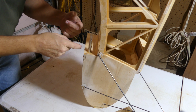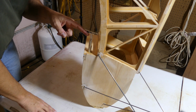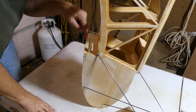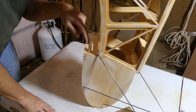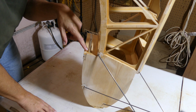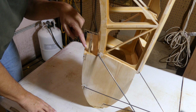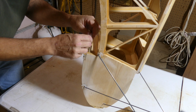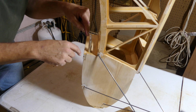What we're trying to do is we're resetting the hole. And the reason why I'm doing it this way, to keep it simple, comes into play if you ever come into a situation where you're trying to move the hole and get everything matched in close, but you want to fill in any little zones where you're not going to get a good connection. Take another 3/8 dowel, and this one I undersized a little bit under 3/8 for this reason. I wrapped it in regular saran wrap, and I will go ahead and pull this down. I will show you shortly because it's not ready to go.